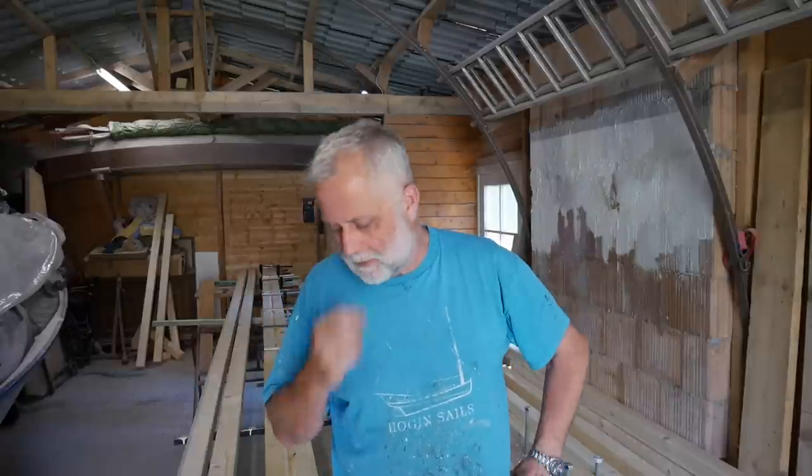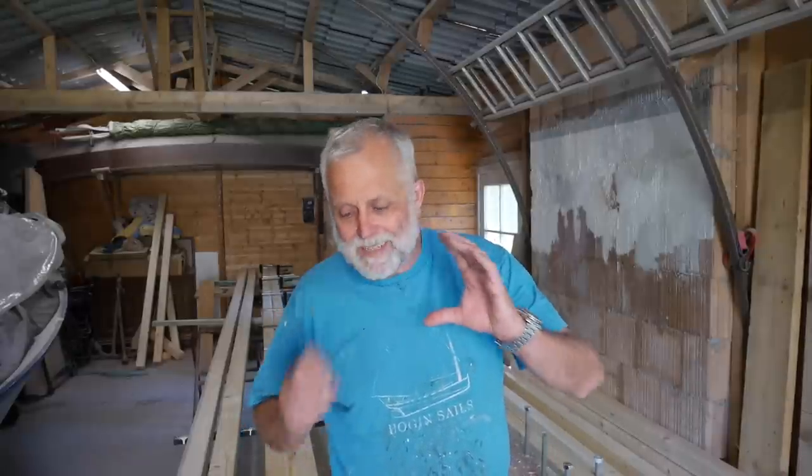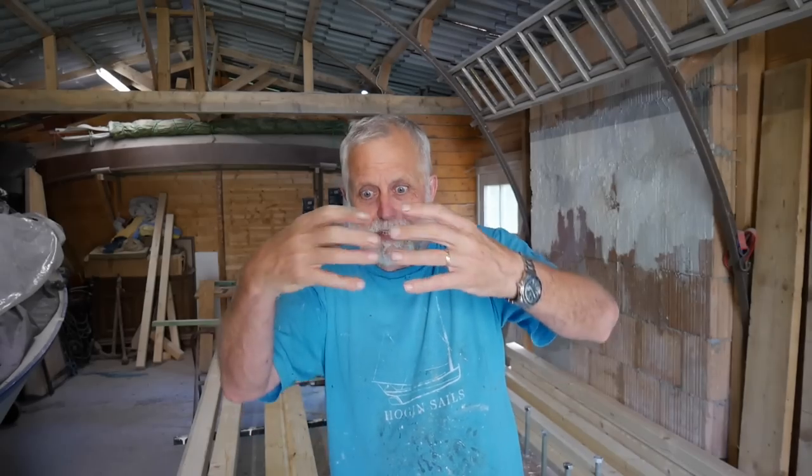But there was a bit of thought about which way round to orient the grain. I had a look at what another builder had done, and then I read some forums, and I decided to orientate the grain as though it were a tree. I think the forum tips I read said that trees basically have it right. So I took off the center for the hole up the length, and am gluing the pieces together so the grain runs circular in the mast.